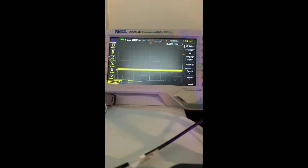So if we now look at some of the inputs on that LS157 at location 3. This is pin 3 coming in from the other board. As you can see, it's pretty much grounded with a load of noise on it. This is pin 5, same, 6, the same. So it's looking like there's something which those are tied to on the other board, which isn't really doing anything. So we're going to have a look at those.